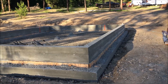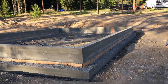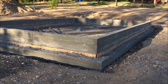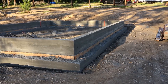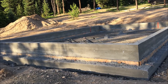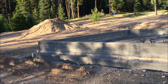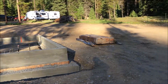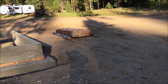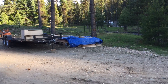So I stripped the forms today. I lost a couple of the 2x6s — I couldn't get them out of the footers. That's why I put the 2x6s on the bottom and the 2x10s on the top, because I'd much rather lose a 2x6 than a 2x10. I stacked all the 2x10s over there to use for the flooring when I do the subfloor. The rest of the lumber is stacked over there beside my trailer.